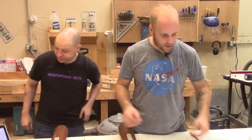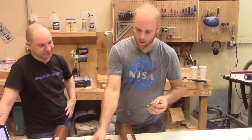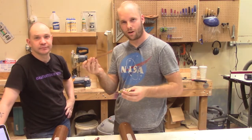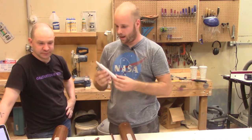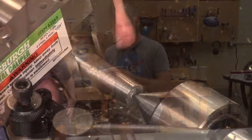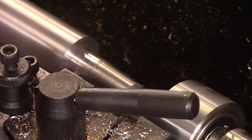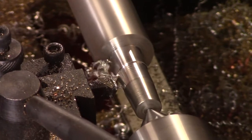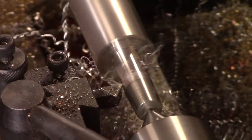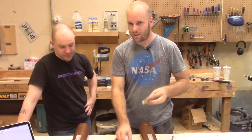So what we've got now is half-inch flex copper pipe here. Our PEX connectors are too big for the interior of our pipe, so what I'm going to try to do is widen them out — flare it out to accept that. To do that, I made this little tool right here. I took a piece of aluminum stock and milled it out on our lathe, milling down to a diameter, putting on a taper, then milling down to a final diameter. The point is to set a taper and then set an interior diameter to flare the pipe out. It kind of flares out then up a little bit, hopefully to accept the connector and make a nice tight fitting. We don't need this to be watertight — there's not actually going to be any steam in this. We just want it not to fall apart.